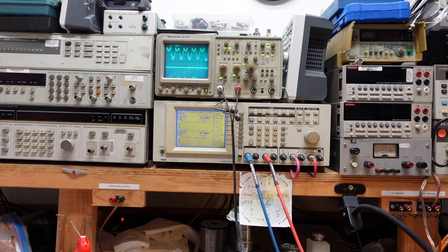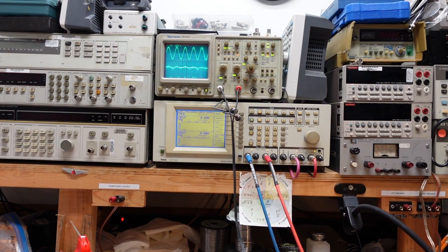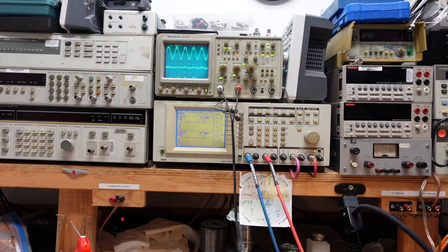Now I've cleaned the tuner, and I may clean it again. I've got some pictures up here. You want to very carefully place DeoxIT or some other cleaning agent onto the contact points only. Don't get anything on the fins. It'll upset your tuning and will have to be cleaned off. There may be a problem in the multiplex section here. I'm not sure. I'm going to tap on the board a bit. Again, it could simply be dirty switches.